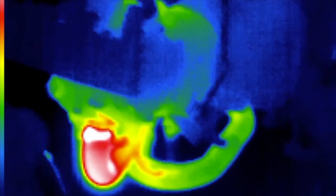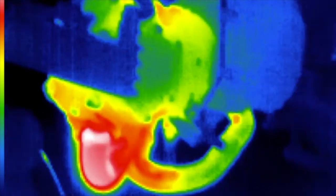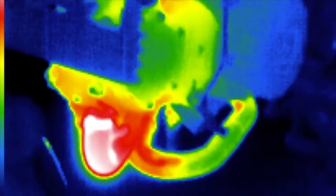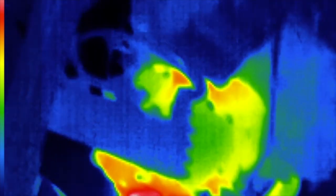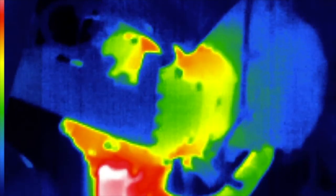If you're pointing an IR camera at an extremely hot object, it's okay to move the sensor around to avoid toasting any of the individual bolometer sensors. Essentially a FLIR infrared thermal sensor is nothing more than an array of tiny heat-sensitive sensors arranged like a CCD or CMOS sensor in a digital camera, or like the retinal cones in your eyeball. It converts incoming thermal IR heat light into electrical signals, which are differentiated by software and colorized into a heat map — brighter red towards white is hottest, and dark towards blue is coldest.